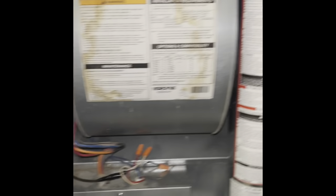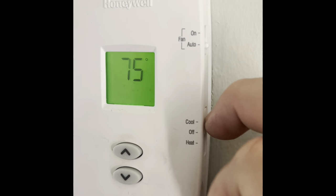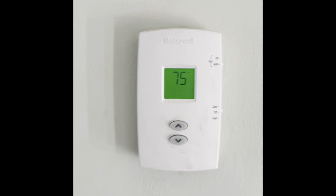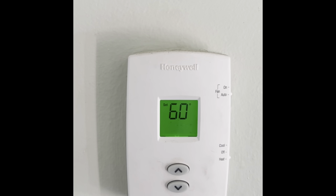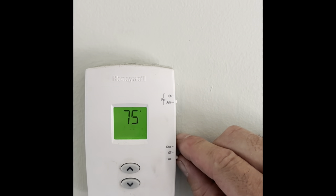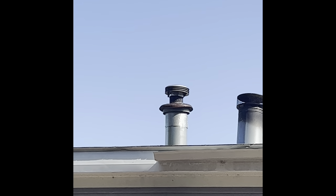No cooling on this one — heat only. Don't stick your fingers in there. I'm going to go over the thermostat. Off. Very simple, basic thermostat. That may say 75, but that's just the indoor temperature — that is not the set point. If you turn it back on to heat and hit it, that's your set point — see, it's set to 60. Back to indoor temperature. Just turn that back off. There's the flue to that furnace. Looks like somebody already put an aftermarket cap on it.